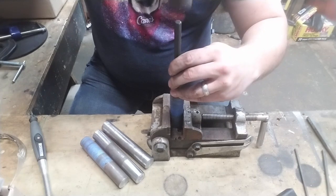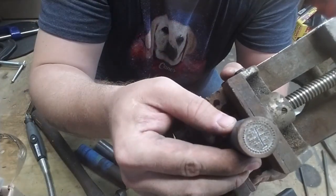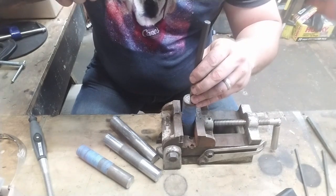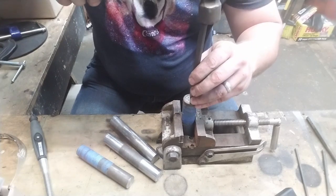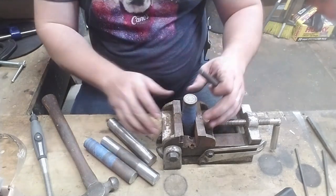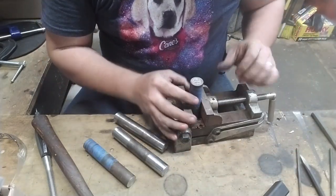This is going to be a project that we make with just two tools. You can see we have a line — I'm struggling to get it into focus here — but we have a very clear line that's fairly wide and reasonably deep, that follows the line I'd previously made punched in with the center punches. It's a little wobbly, so what we're going to do is chase over it very lightly. It's almost like planishing — we're planishing with a liner punch, and that will straighten up the line. It will also make it a little bit deeper and more prominent when it's eventually struck on a coin.